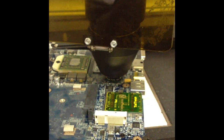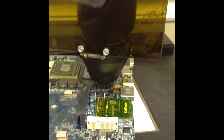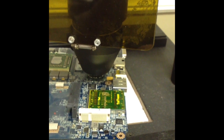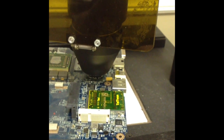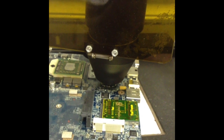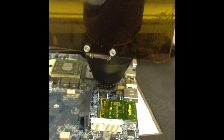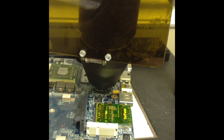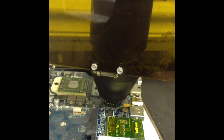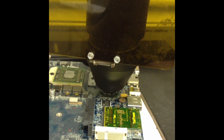It's very important to get this preheated correctly. You have to let it sit on the preheater and heat up — that's to clean off any residue you may have been using to polish the chip or clean the board. What we do is run our stuff through ultrasonic, so you have to make certain to preheat it so everything dries out and it's actually making good contact with the reflow process. We're going to let this preheat and then actually flick the switch and start to solder the board.